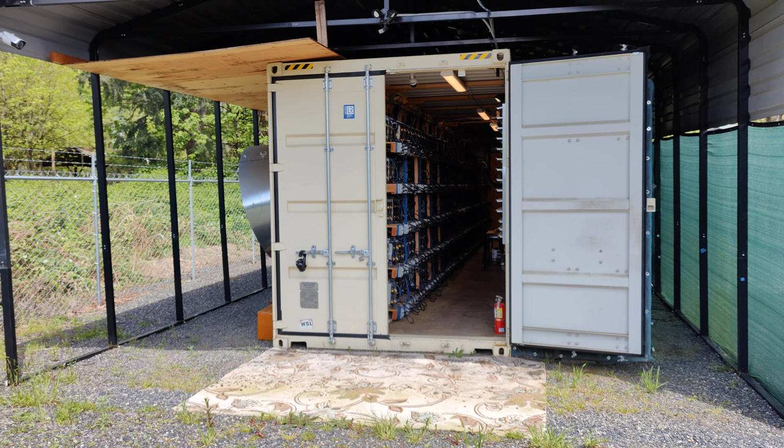The adjustments we had to do on these two containers is we had to switch around a couple of the miners. So here's transformer one, transformer two, and the gears in the back over there. And the gears have their own breakers, 600 amp breakers on that one, and then I think I have a couple of 600 on that one as well, and a 200. So to not get it to trip at 600 when it gets warmer outside, as the miners use more electricity, we needed to offload miners to different breakers.